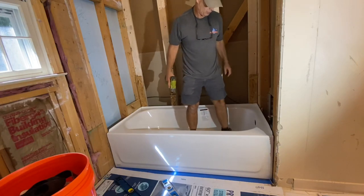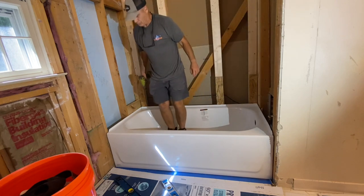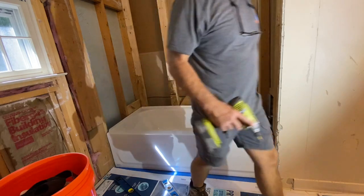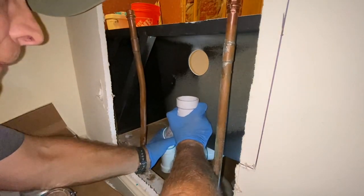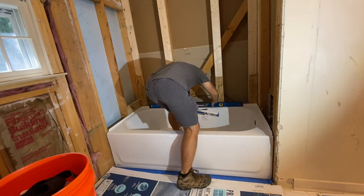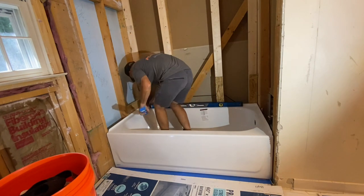If this is the first time you've set a steel tub, you want to make sure that tub doesn't move at all before you get your drywall up and put your tile up — and really even before you start putting your waste and overflow on. Before we actually get started, I also want you to understand how important it is to make sure that tub is as level as you can get it on all three sides.